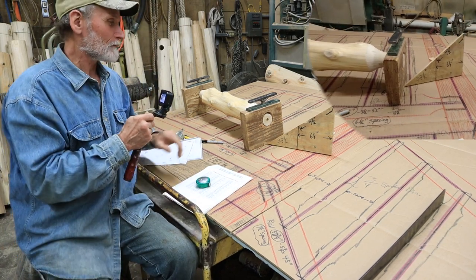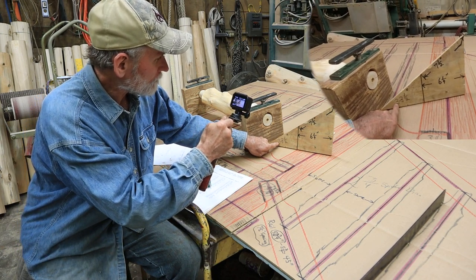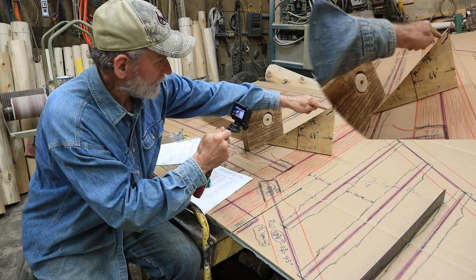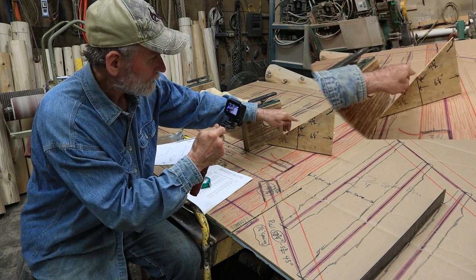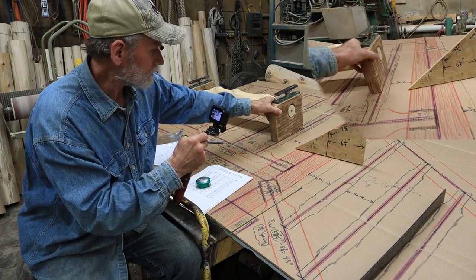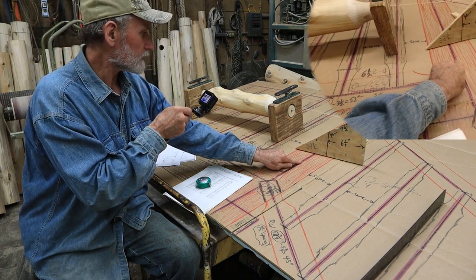in my adventure. So here we have, right here, this is our stairway pattern, 33 1/2 degrees. When you move over 6 1/4 inches, the actual angle on the stairway travel is 7.5. So to make all the numbers work, we're going to start with the easy one first, just straight horizontal rail, where we have the thickness of a spindle versus the thickness of the post.